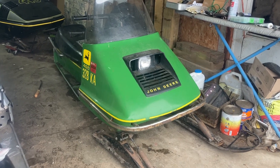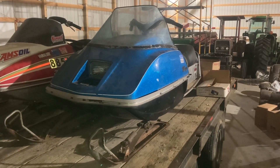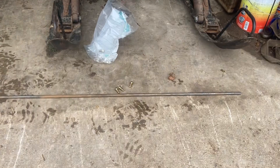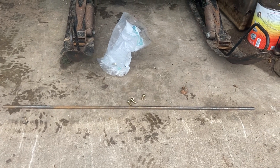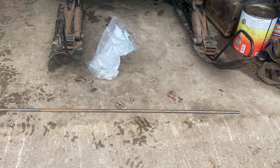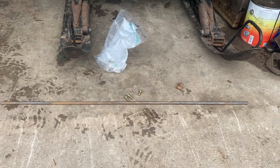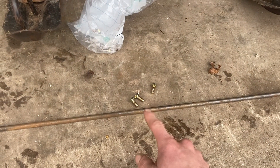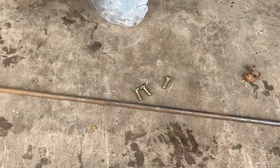You're getting new wear bars, and you too are getting new wear bars! But we don't have any, so we're going to have to make them ourselves. For materials, we really just need our rod, which is three-eighths inch cold rolled steel — I bought those in 12-foot sections for eight dollars for the entire 12 feet. We also need bolts that will be welded to become our studs: five-sixteenths by one inch long, grade eight.